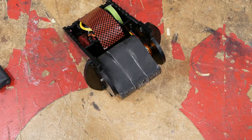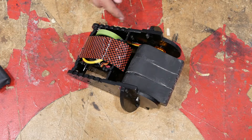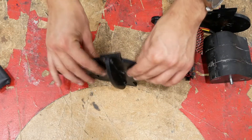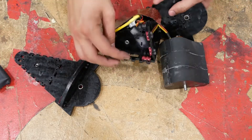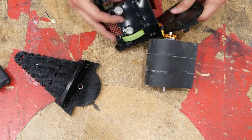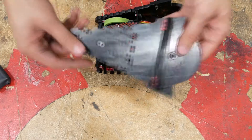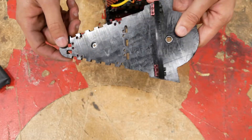Finally, we're back to Black Death. Here we have the Delrin design again — in this case, there are no holes tapped in the Delrin; it's purely for structural integrity. Taking it apart, we can see there are three different sizes of Delrin: a quarter inch thick on the exterior, an eighth of an inch thick for the interior piece, and a sixteenth of an inch thick for the battery holder — the most delicate of all the pieces. There are slots and holes for the nut strip to hold everything together.